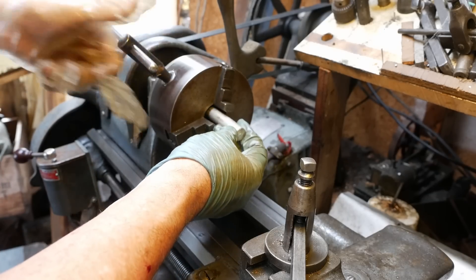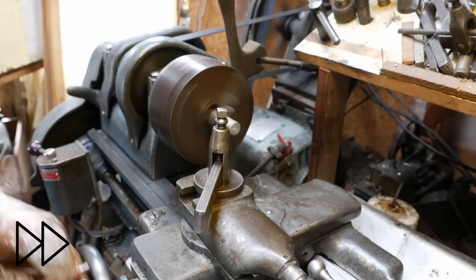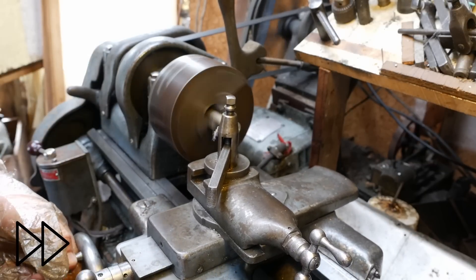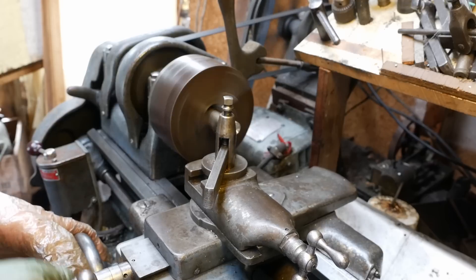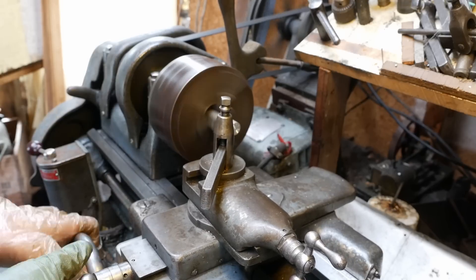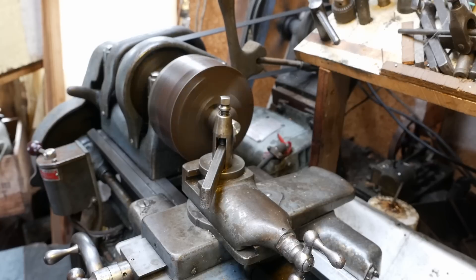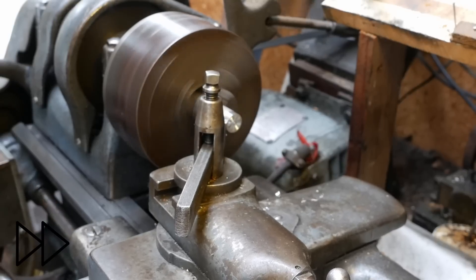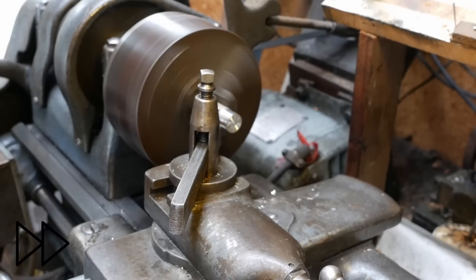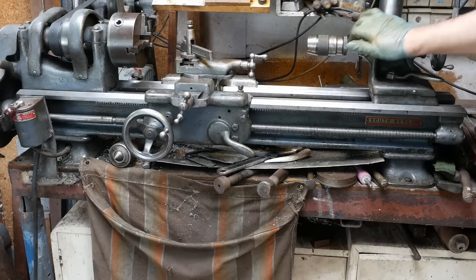With the drive not secured properly I'll just take a light cut. Not sure if that's on centre height - I think it's a bit too high. Automatic feed. Well, can't really argue with that - it's only aluminium.